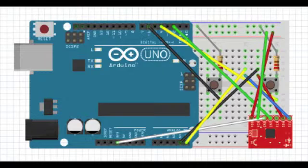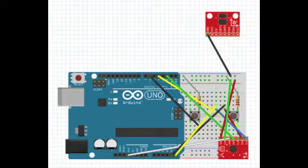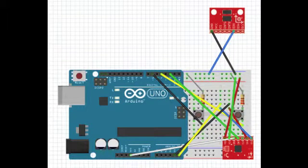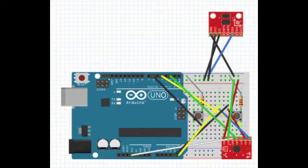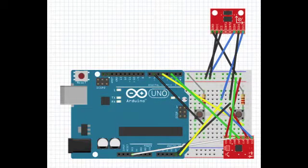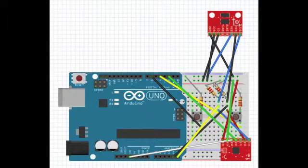After completing wiring for the accelerometer and gyroscope, I then moved on to the wiring for just the accelerometer. The other accelerometer, unlike being glued on the breadboard, is attached by 6 freestanding wires, 4 of which are used for power source and output. The last 2 wires are placed on the opposite side of the wires connected to pins A4 and A5, allowing the return of information by the accelerometer. I also have 2 resistors which are placed next to these wires connected back to ground to give it the base current of low.